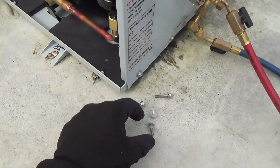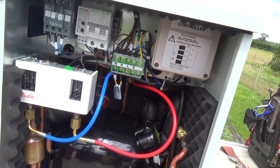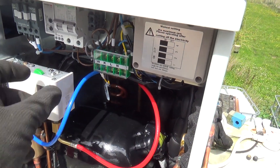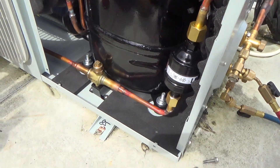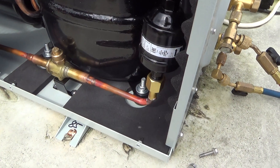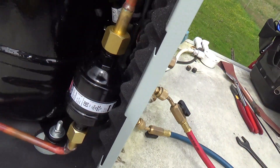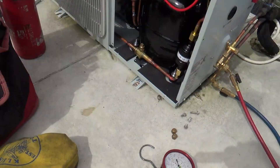Got the cover off this. I've noticed the screws are M5 instead of M4 — that's a bit better, they go in better, less likely to get them cross-threaded. It's not a bad little unit actually, I'll give it its due. It's got a delay timer I think, maybe for the compressor. Manual reset HP. It's got a little muffler on there. Discharge ball valve, you can pump it down. Flare fittings to change the dryer — they've got copper washers in there so you can put a new copper washer in every time. Sightglass Danfoss. Yeah, it's not a bad little unit.